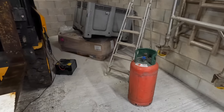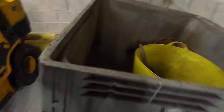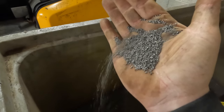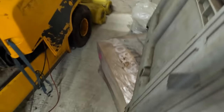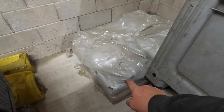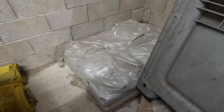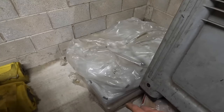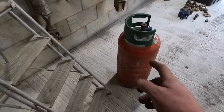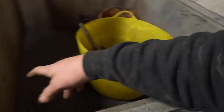So yeah, look at this. I'm going to make it so, let me get a bit of this out. That's what's in that box underneath. Believe it or not, there's a ton there, 1,000 kgs of media, and there's hardly any out there. There's about a bag and a half of iron silicate there, that's probably about 200 kgs, maybe 150 kgs. I haven't got any glass in here. I've got some glass back at the van, but I'm going to make it so that this pot is going to be able to blast. This is like top end at scale.